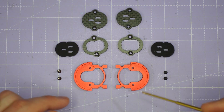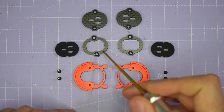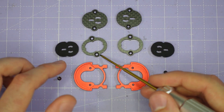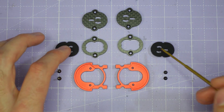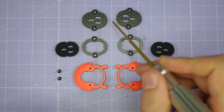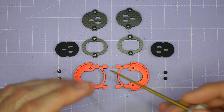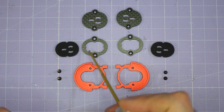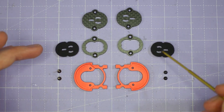Let's start by building up the brand new 7000 series aluminium camera cage. For this you'll need the two camera cage parts, the two soft mount camera plates and potentially the two hard mount camera plates. If you're building for DJI-03, you're going to be using the two soft mount camera plates with the two included silicone gummies. If you're wanting to hard mount a 19mm analog FPV camera, then you are also going to use the two hard mount camera plates as well. If you're mounting some other type of camera, maybe a 14mm camera, there are loads of 3D prints available that fit these soft mount camera plates.